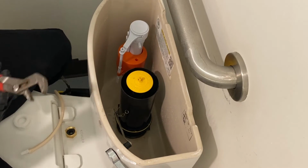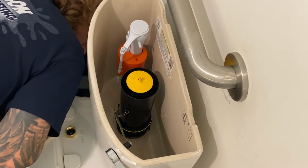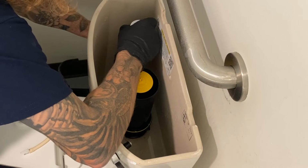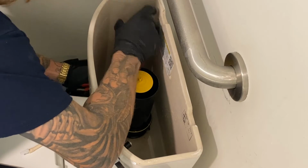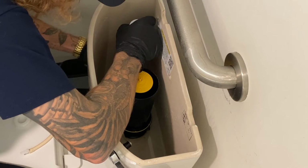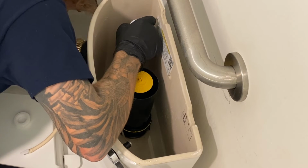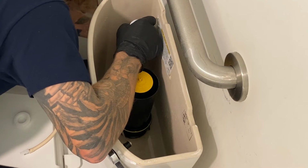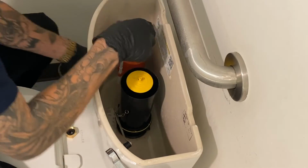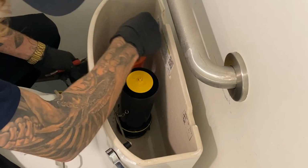We'll go ahead and take our channel locks. Get back underneath. Now it can be kind of confusing because it's upside down, so you'll be threading the opposite way. You just want to be careful. You want to hold this guy because there is a chance that it will spin with the nut. And you really only want to give it a couple turns. It doesn't need to be super, super tight. You don't want to break the porcelain or anything like that, but as you can see, it's nice and solid in there.